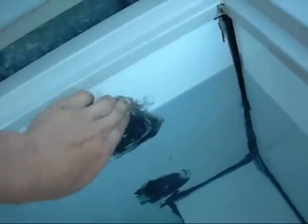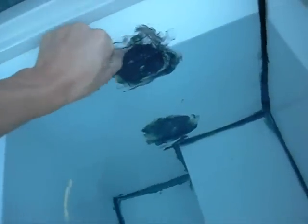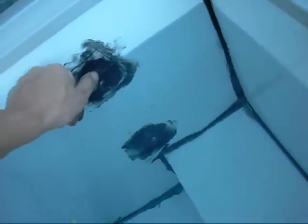The silicone's just black roofing silicone, and that's not coming off. I just roughed the surface up with a bit of emery cloth, and then wiped it down with acetone. Wiped the plastic sheet with acetone and let it all dry, and then stuck it on and just lined her out. Really easy. You stitch it out from the outside. You shouldn't get too many air bubbles, although some of them showed up, like stitching a patch on an inner tube or something. And yeah, it's worked. They haven't lifted. No water leaking out.